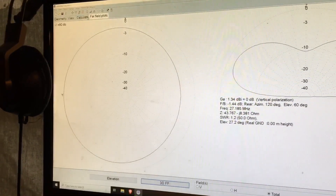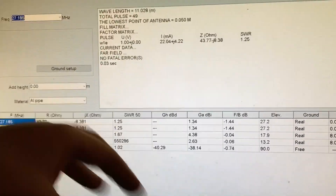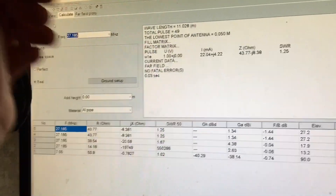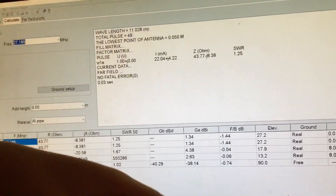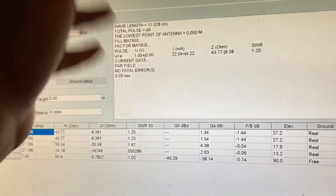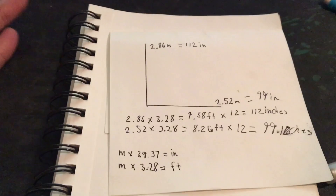So what we're getting here is theoretical. This is tested at a frequency of 27.185 MHz — that's middle of the band, channel 19. It's the middle of the band because of alpha channels — I've already talked about that but look it up if you want to know more. Our SWR over 50 ohms will be about 1.25, according to the modeling software — take this with a grain of salt. You can change the radiation patterns by changing the vertical or horizontal lengths. A free space dipole is going to be 217 inches total.